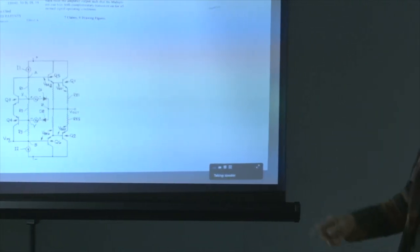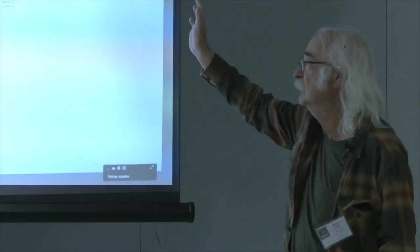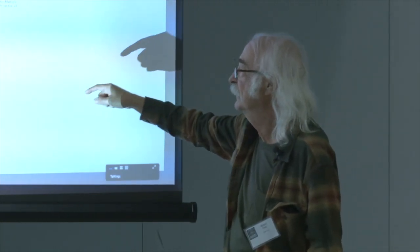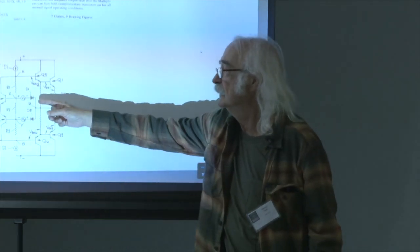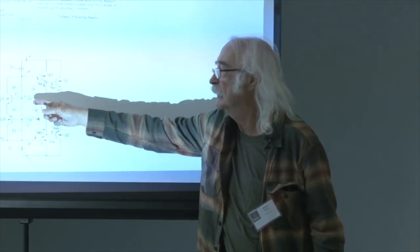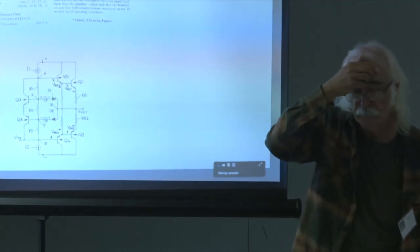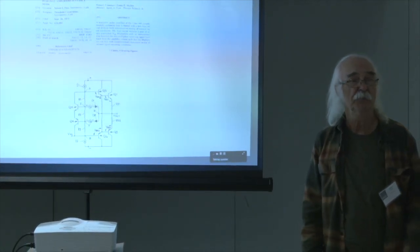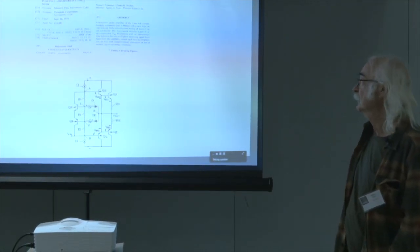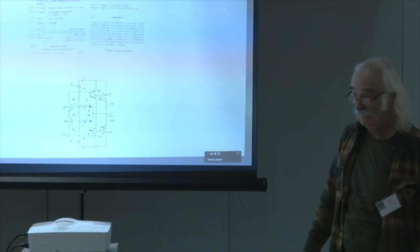And in the case of this, as the output current swings positive, you find that this Q1, the voltage across it, will increase by virtue of the fact that there's a negative voltage being applied to its base by virtue of its connection here to the output. This one was a far more effective non-switching piece. And actually, correctly done, the diodes never fell out of conduction, so there was really class A everywhere.